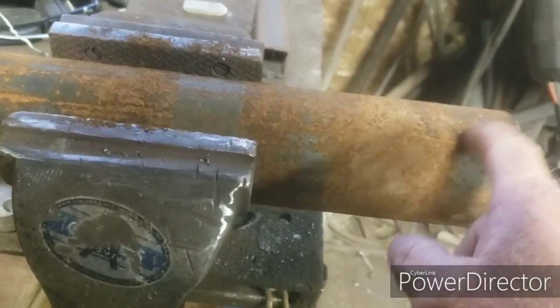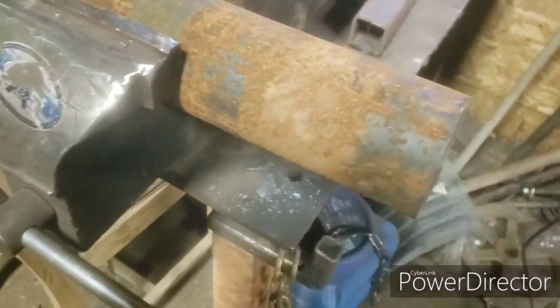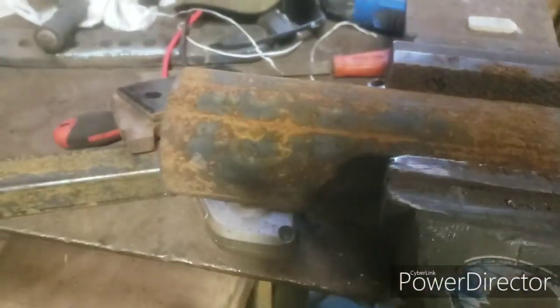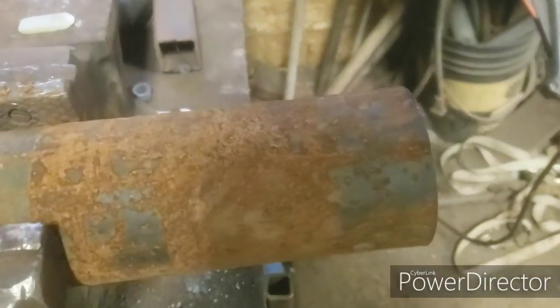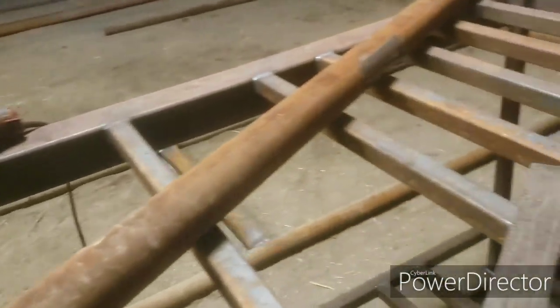This one I'm gonna saddle cut anyways. I think I'm gonna keep saddle cutting the feet just because I think it is probably a little bit stronger, maybe. I don't know. I guess I could weld it the other way too and just try one, but I'd sooner just try that on my own panels and see. So yeah. So now I'm gonna cut all these, I guess, and get them marked out and then cut them and weld them to the feet, and then I can stand that panel up and mount the feet onto it.